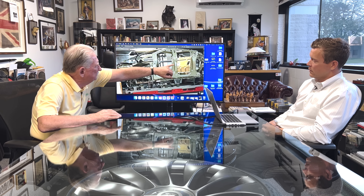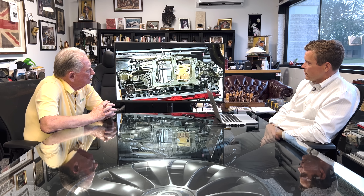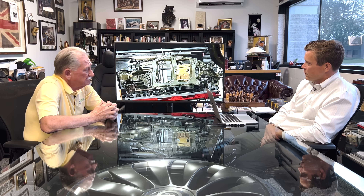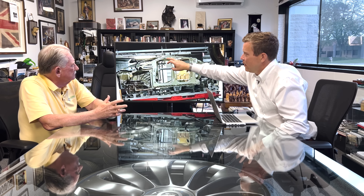This is where you've got crash worthiness issues. You have the roof tie coming up to the B-pillar right here. This is telling me that this has an inner framework — basically the body inner. Consequently, we're looking at something that is not the same as what I was hoping to see. What I was hoping to see was a true example of an exoskeleton. This is a skeleton right here. Why did they do that? My guess is rollover crash worthiness and all kinds of other things.